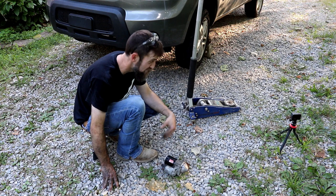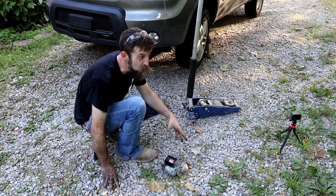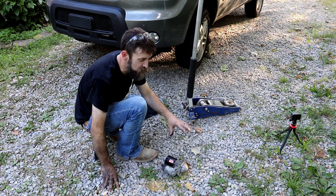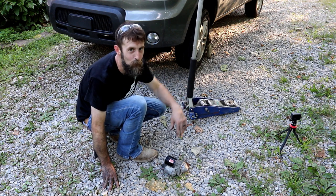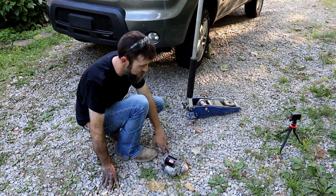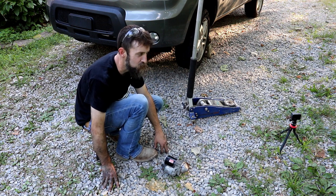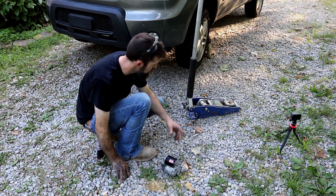But I've seen videos where guys were pulling intakes off of them, pulling exhausts off. I can see why. It's tough, but it will come out of these little Kias if you snake it along the firewall and go up beneath the brake booster. You can get them out without taking off a ton of extra stuff. It's a tight squeeze, but it happens.